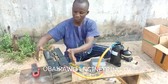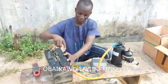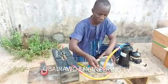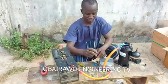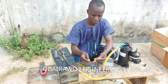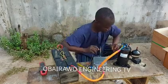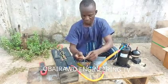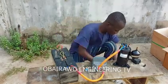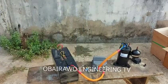The compressor is working very excellently well. Ladies and gentlemen, you need to know that this is 4 batteries, which is 48 volts. As you can see, the wiring goes to the motor controller, and from the motor controller to the compressor engine. That is the switch, and this is the cable that will be connected to the thermostat. By disconnecting it, the compressor stops. That is the 2 yellow cables. The yellow cables for the thermostat can be bridged together for test running alone, and are to be disconnected and connected to the thermostat when installing it properly.